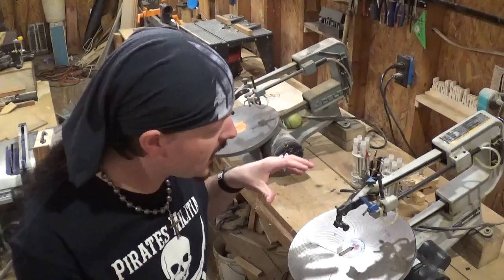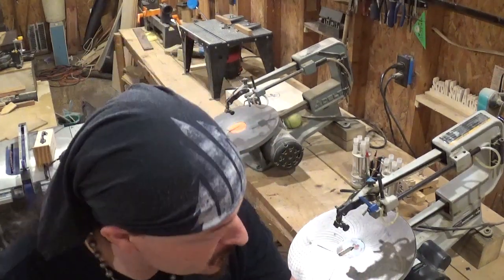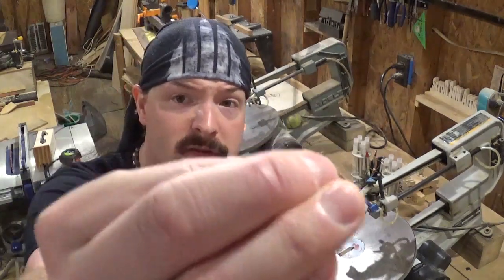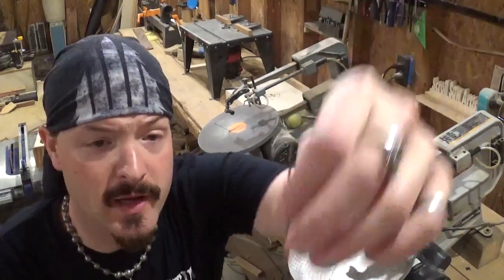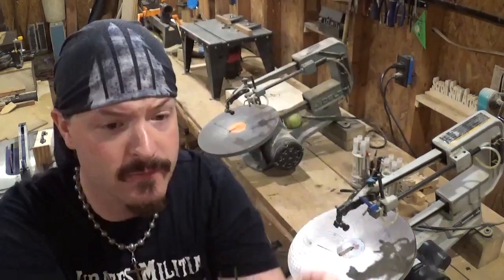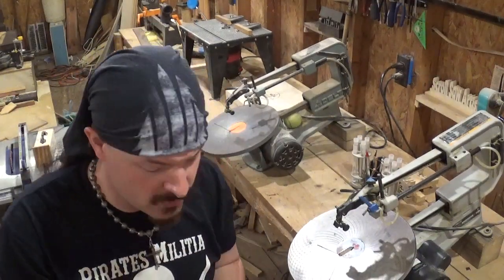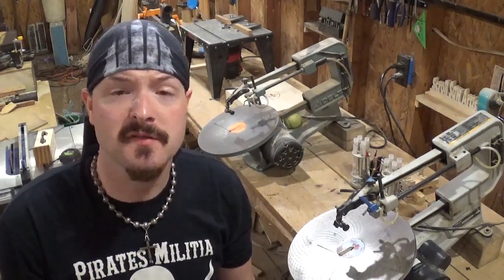For compound cutting on the scroll saw, you need to have your scroll saw at a perfect 90-degree angle to the blade. Speaking of blades, I'm going to be using a thicker blade than I normally use. This is the blade I usually use, which is a number 5. Today we're using a number 12, and if you hold them side by side you can see the difference. The number 12 reverse tooth blade is better for thicker wood, and if you take your time your cuts are going to be nice and pretty. I'm going to get the blade threaded through one of the interior cuts and get started.